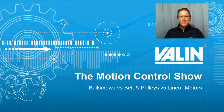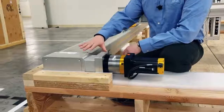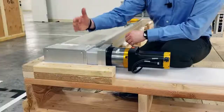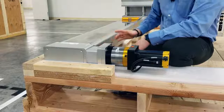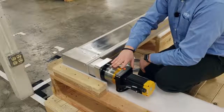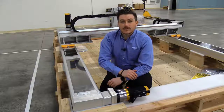I'm going to have Michael Renault give you some visual explanation of a couple differences. The HMR series is able to come as a belt-driven actuator or a screw-driven actuator. We know these are belts based on how the motor is mounted to the actuator itself. If this actuator was a screw-driven actuator, the motor would be mounted in line with the axis of motion right off the end, or it would have a wraparound in parallel with the axis of motion. In belt and pulley actuator applications, most of the time we have to utilize a gearbox to match the inertia that is reflected back on the motor due to the low mechanical advantage that the belt actuator provides us.